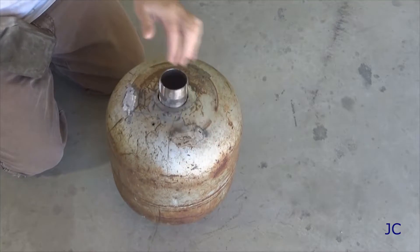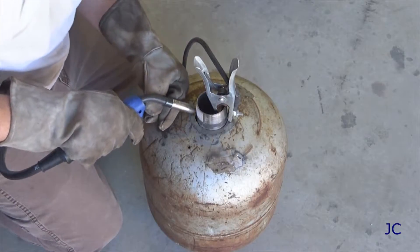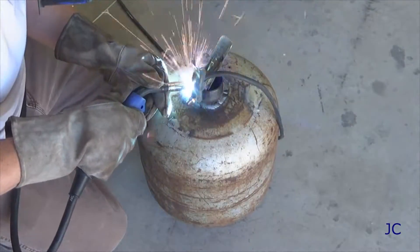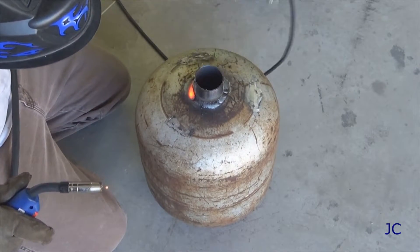Now that we've got that all clean, we're ready to set that into the top of the tank so we can weld it in place. It should look about like this. We're ready to weld this all together. It's important that you take your time and make sure you get good welds on this. I went ahead and doubled up on the welds - you want this to be stout. We're gonna put a lot of pressure in this tank, and this is a crucial part in this process. We do not want this to fail.